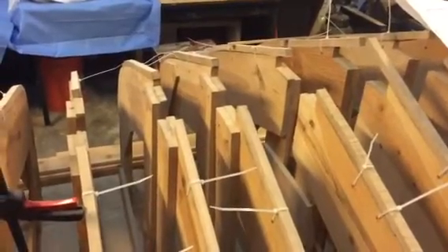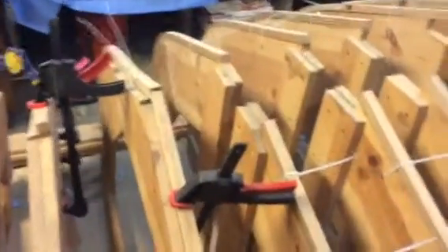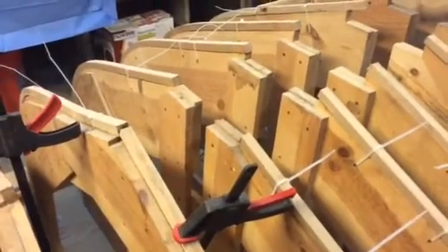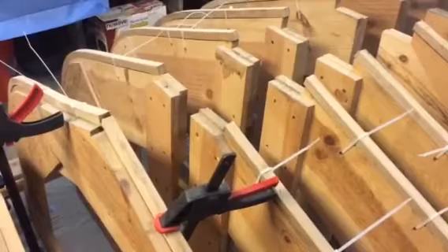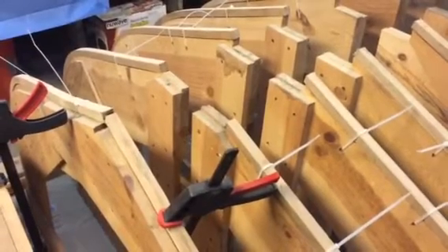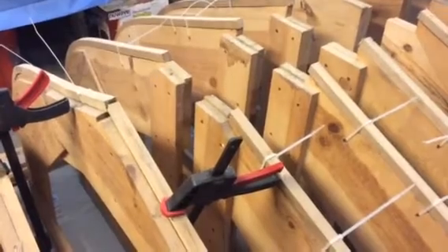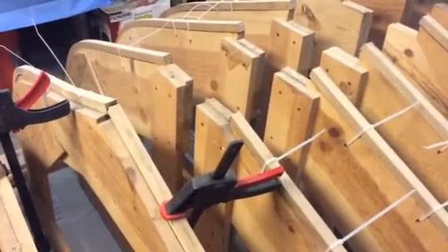These molds are a little old. As we come aft here, the furthest one back — I don't know what frame that is, number 16 I believe — is not quite three inches. So I may have to take that frame apart just a little bit and widen it, or either plane the inside of that slot.